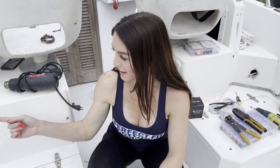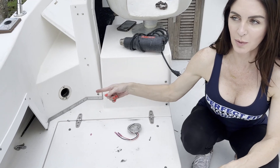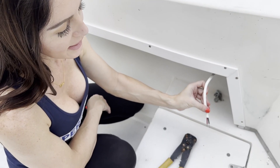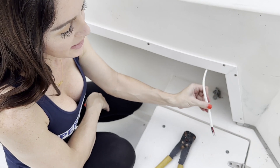These lights are wired starting at the fuse block and going all the way around the boat, ending up right over here. We are going to start working right here at the end and work our way back. Always use marine grade copper tin wire — this one right here is a 16 gauge.